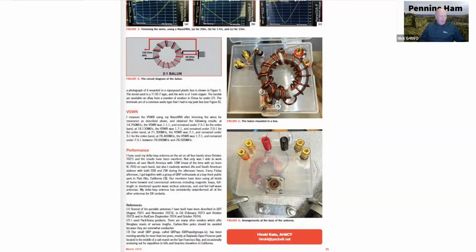It's a great article. I've got just one question for you that occurred to me about building this antenna. Instead of constructing a balun, what about running the feed from the antenna as twin feeder into the back of an ATU with a balun built inside it, so that you're matching through to the open feeder rather than coax cable? I wonder if you had a play at doing that, or did you do it exclusively using 50 ohm coax?